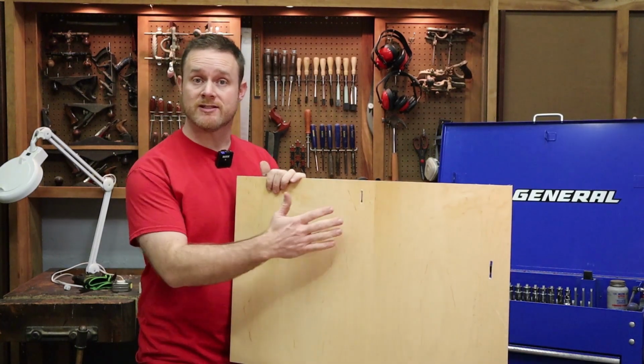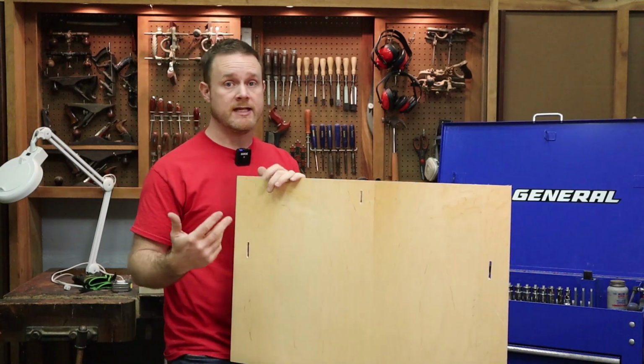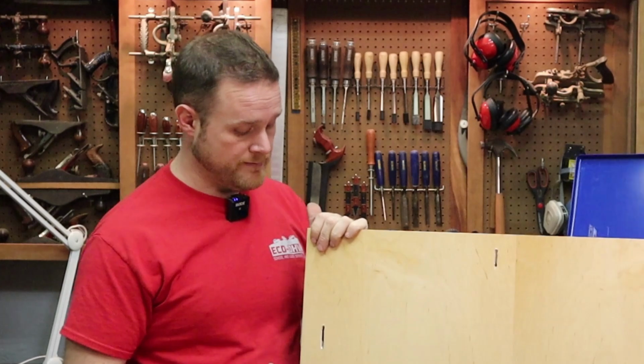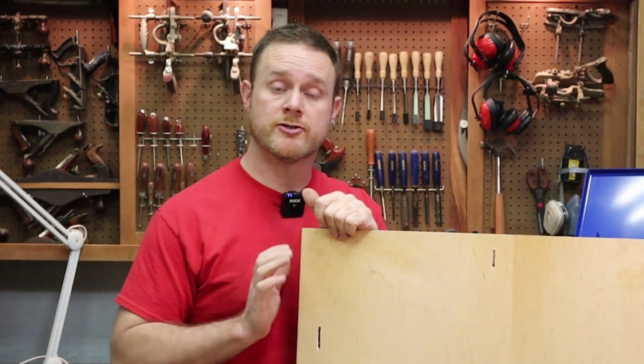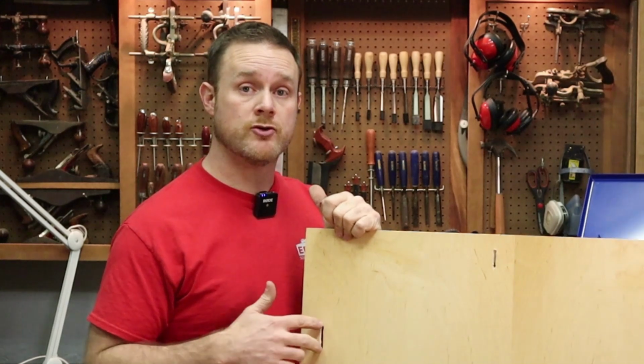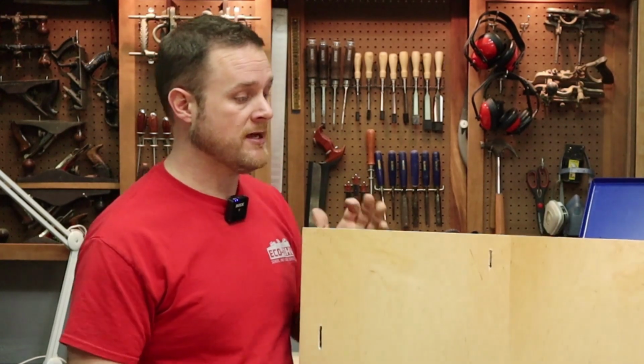Make sure your cart matches the measurements before you start cutting your plywood. It's possible that there are different versions out there that I'm not aware of. But it's very simple. You can use a table saw or a circular saw to cut the width and length, and then we just used a drill and a jigsaw to cut out the slots.